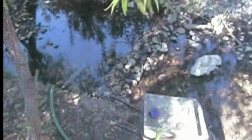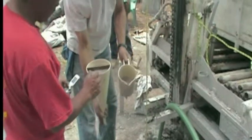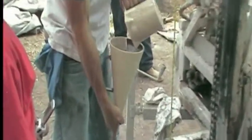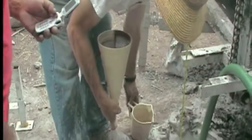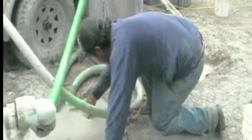Having lots of water is very useful in the later process of cleaning out the actual borehole. Here I am checking the viscosity of the mud to make sure that it stays consistent, which is important in the drilling process. Then we clean out the pits and get all the debris and cuttings out — it's an ongoing process.